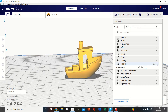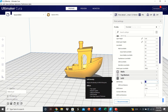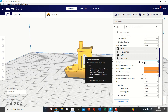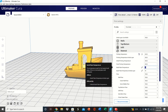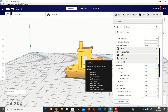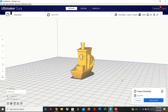I'm dropping the Benchy in — the standard 3D Benchy boat. We're going to print with no supports, as I believe that's how you print Benchies. I've actually never printed one, so this will be my first. I'll add a skirt just to make sure everything is printing properly. For this one I'm setting infill to 100%. The two most important settings: nozzle at 245 degrees, and the bed I'll leave at 70 degrees as recommended. Print speed at 50 millimeters per second, cooling at 100%.